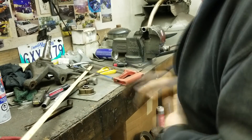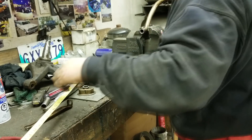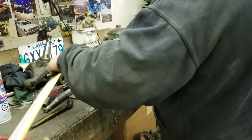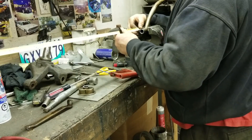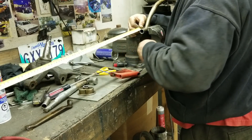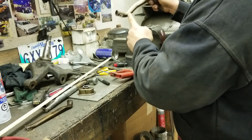There's kind of a thicker lip here so I'm going to cut it just at that lip, then cut it just below that lip at the inch and a half, and then I'll be able to weld it back together. I'm going to use a hacksaw so I can do it more carefully and slowly. First I should mark it — I want to make sure this gets welded back on the same way it's pointing right now. I made a little mark there and a little mark there so when I cut it I'll just line those marks up and it'll be positioned the same way it was before.